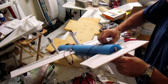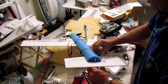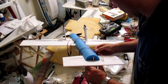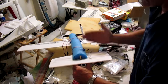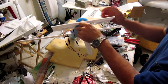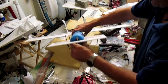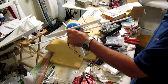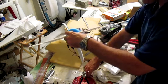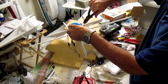We're gonna have to reset the servo arm on the servo. Not a big deal. Got to reset that so that the servo is perfectly horizontal, so we get a full throw. All right, let's get that. Let's tighten that control horn down, that easy connector rod. Let's get that down there, because right now it's not doing what it's supposed to do.